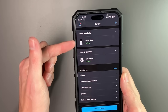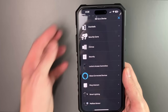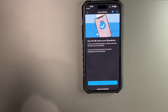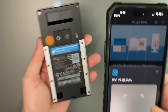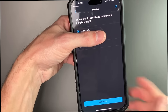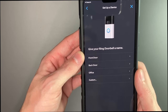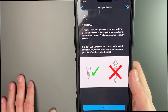In the app I already have my front doorbell and driveway camera. We'll go ahead and hit 'set up a device,' go to doorbells, and then scan the QR code on the ring device — there is a QR code on the back. We'll say we're ready to scan — got it. It now shows my address. We'll hit continue, and now it asks what you want to name it: front door, back door, office, or something custom. This is going to be my front door.